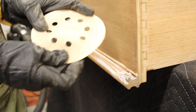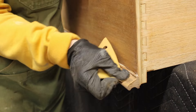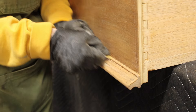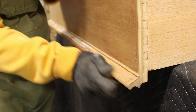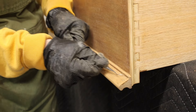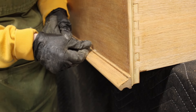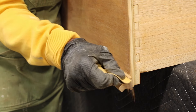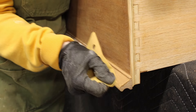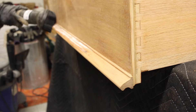After the stripping was done I used 120 grit sandpaper to get the remaining bits and pieces off the front of the drawers. As you can see I follow the grain — that way you're not going to get as many marks on the piece. I always wear gloves because I just can't stand the feel of sawdust on my fingers. I use a little dental pick to get the little pieces of paint and grain filler out of the hard to access areas and go back to sanding, keeping switching back and forth. I'm pretty picky so I'll do this several times.